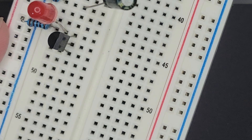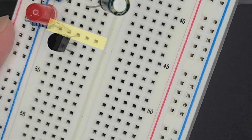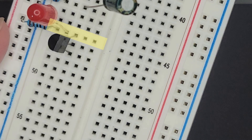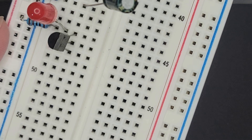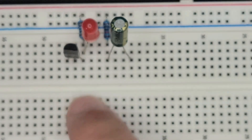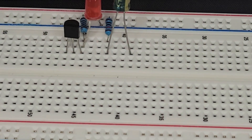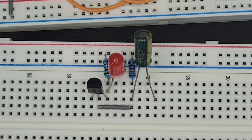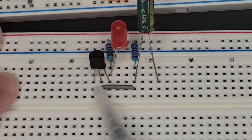You can see that the resistor is lined up with the LED and the collector of the transistor — they're all in a straight line — and of course he goes to ground. Next up, we need to connect the base to the capacitor. So this base here needs to connect to this capacitor. So we have our base connected to the capacitor.